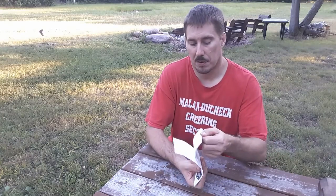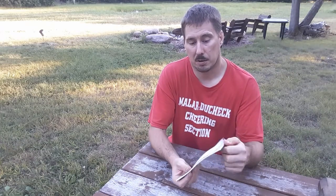So what I'm talking about with the grain on a tool — if you imagine a piece of wood, you'd tend to have sections of wood running in one direction. They're essentially, by a natural process, kind of glued together, and it makes the wood very strong in one direction and not so strong in another. So this little booklet of papers here in this direction, you can see it's quite wibbly-wobbly and weak, and if I were to bend it, the papers want to come apart in that orientation. Whereas if the forces I was applying were more along the length of it, it's much more rigid, and I would actually have to tear these papers in order to break it, versus the force being in this direction where these things can tear out.